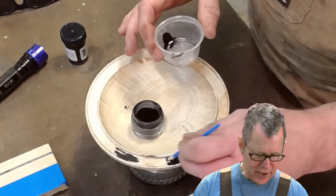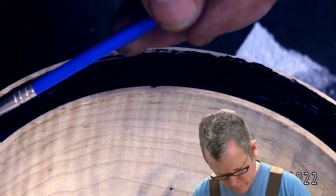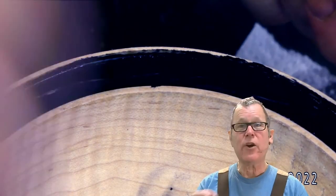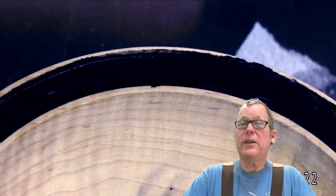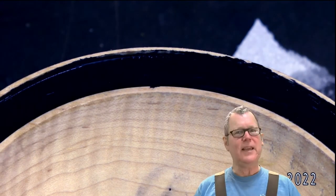You want to be sure that you get up on the edges. I'm not too worried about if I've got any on the top because that's going to be sanded off. I also sealed that so I've protected the grain. So don't only just seal the groove — make sure you seal the surrounding area also. I can let this naturally dry, or I like the Glue Boost because it doesn't bloom or blush and turn your CA white. I can go ahead and hit this right away, let that kick, and I'm good to go.